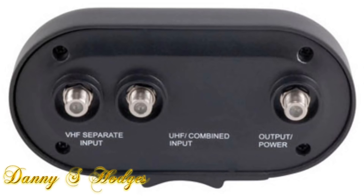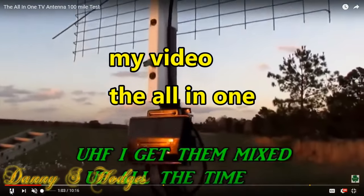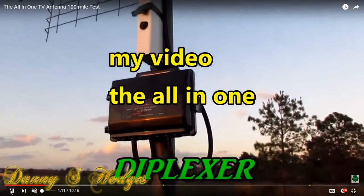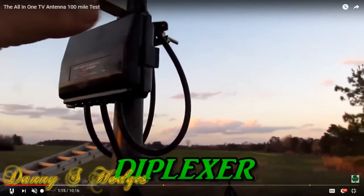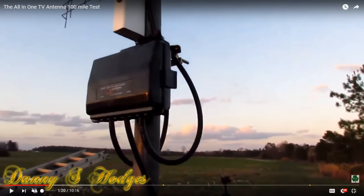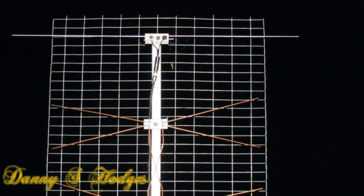Or you can simply get one of them — they call it a combiner — for UHF and VHF. In other words, you would have two transformers and two wires. It'll be separated and that right there works good. The man done a good job on the antenna, but he didn't sit there and show you how to build it — he'd just have it laying on the table and do stuff off camera, then come back and say 'here's what I got.' Now he had his whiskers short. The antenna will pick up with short whiskers, but long whiskers make a difference.